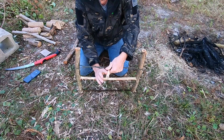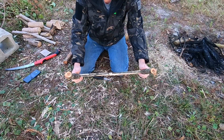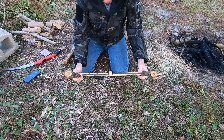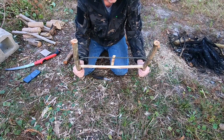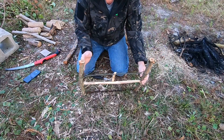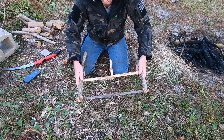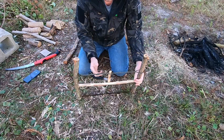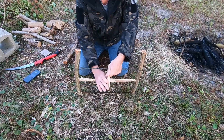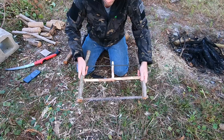So what I'm looking for is rocking. I'm going to make this windlass just a little bit longer. When you're looking at your buck saw and you tighten it, you want to sit there and try to move it and see if it will rock. Rocking means that one leg will go up and the other will go down — it's sloppy and bounces around. You don't want that — you want it nice and tight. Usually with rockage, and it will happen when your wood starts drying out, just tighten it up again with your windlass. Yeah, that's stout.